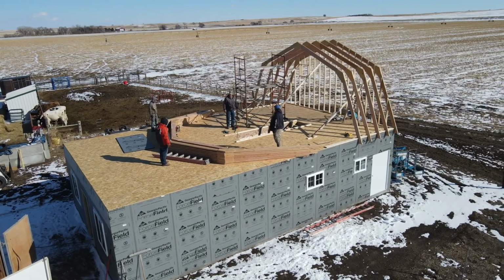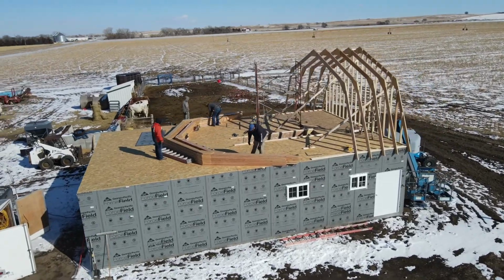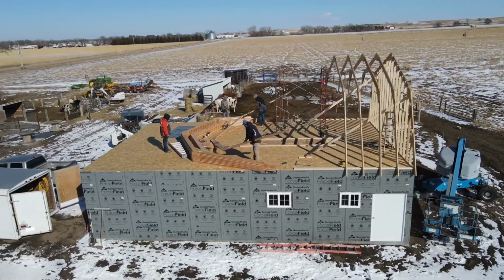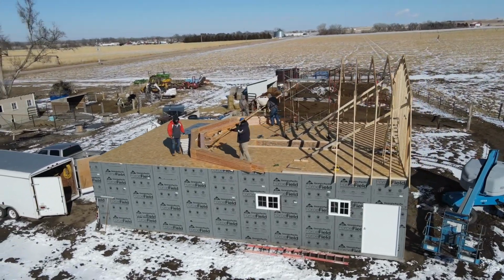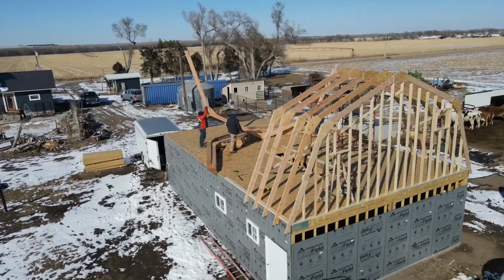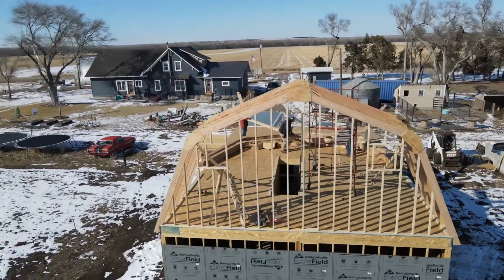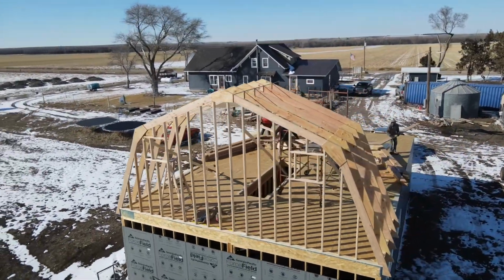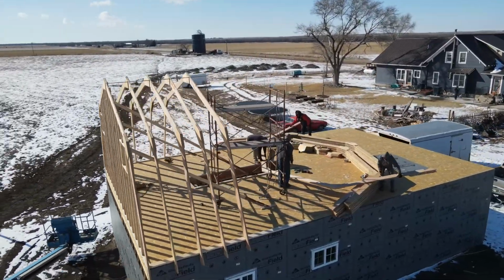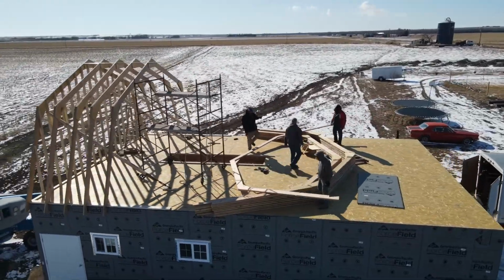One of the biggest headaches was getting the gusset on the back side. Each time we did that, we had to flip one rafter over, fasten the gussets, and then we were standing them up as we made our way across the deck. The problem was that our space got more and more limited, and we had less and less room to build the rafters and then get them stood up. So what we ended up doing was moving them all to the edge, putting the back gusset on each one of those, and then standing them up and making our way to the end of the roof.